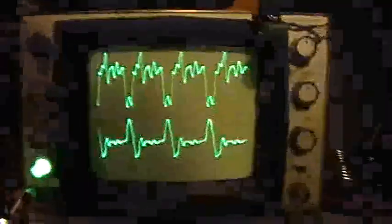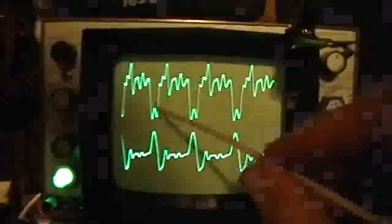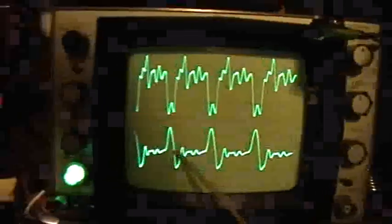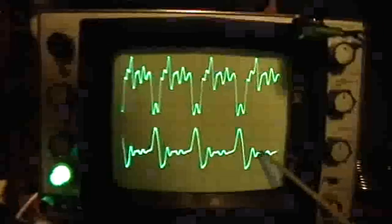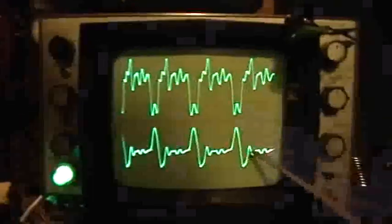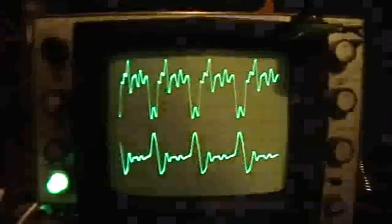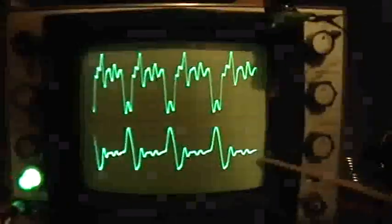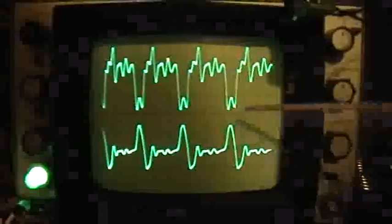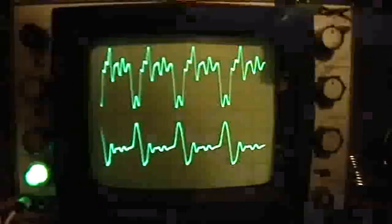This is going to produce a strong negative power product — I've already calculated it. The baseline for the current viewing resistor is right here, and there's a great deal of negative-going spikiness. The zero trace of the battery shows a negative spike that gets multiplied with some positive content up top. Without correcting for the inductive reactance of the current viewing resistor, you get a mean power of about negative half a watt. Even accounting for inductive reactance, only the magnitude changes — not the sign — so there's a strong negative result.